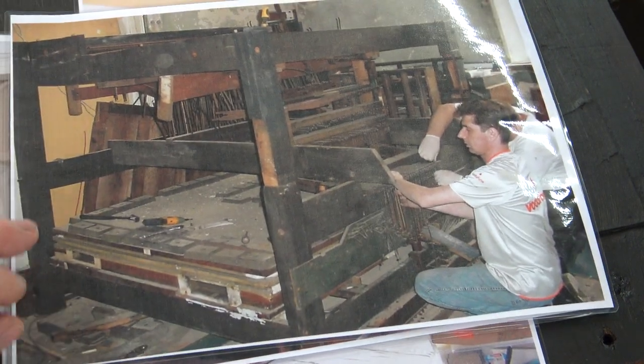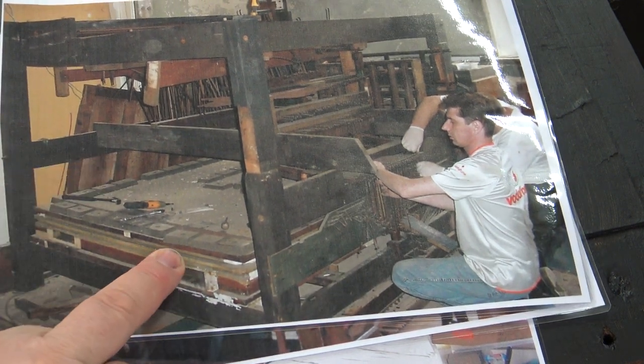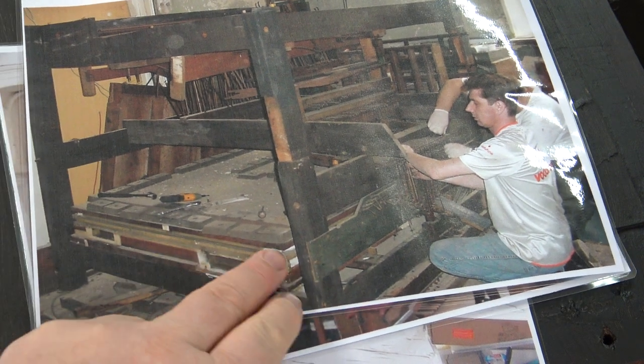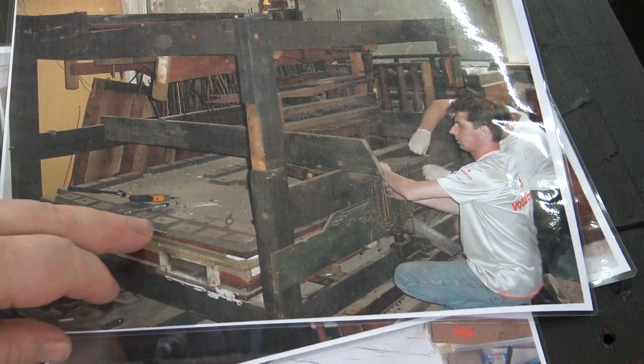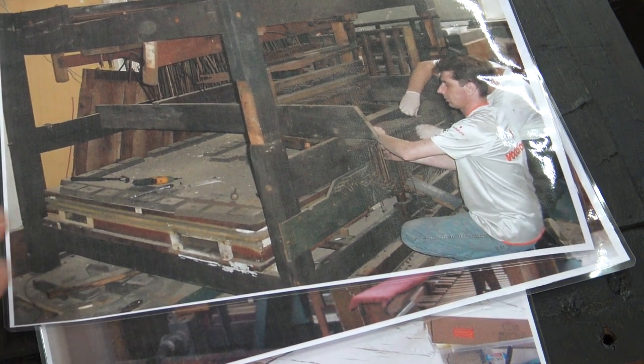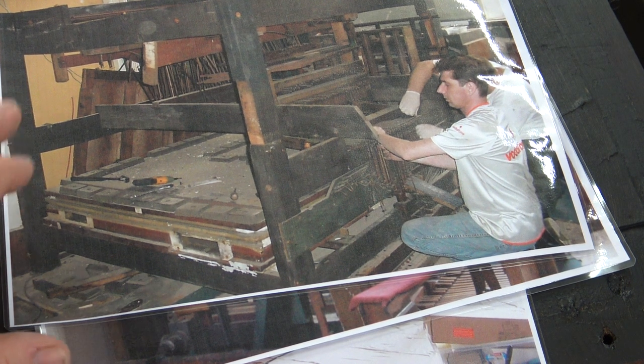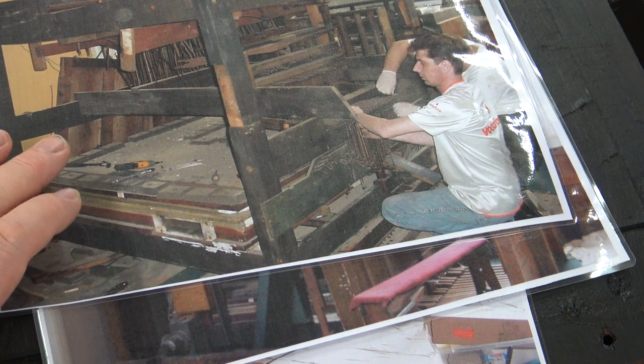So you can see it's on a building frame. But the reason I'm showing these pictures is, hey presto, there's the bellows the right way up with its weights on. It has cast iron weights, and they produce the exact pressure the organ requires. I'll have to look at my notes, but the standard on most pipe organs of this kind of size is about 3-inch water gauge. And that's how far water in a U-tube shifts when you apply pressure. So that's where we are.